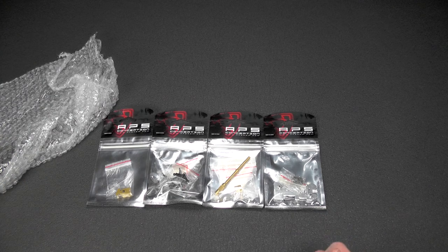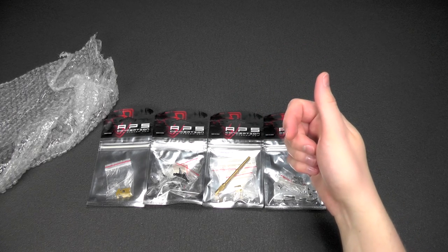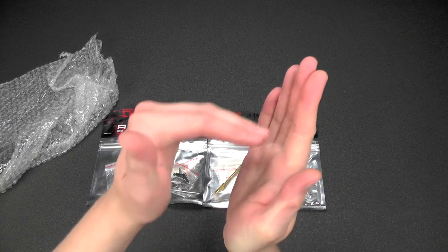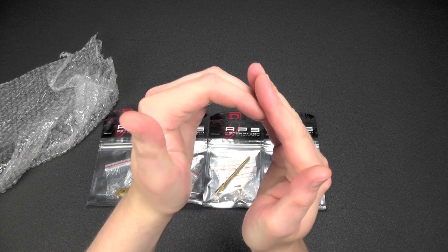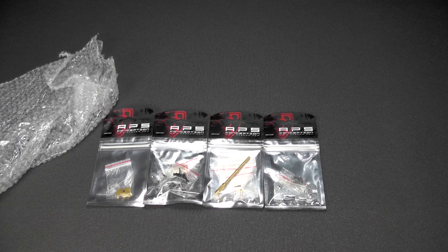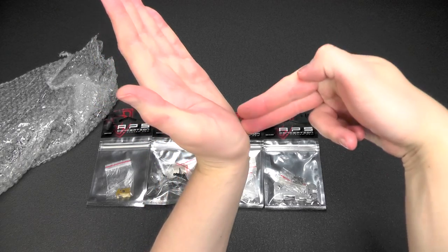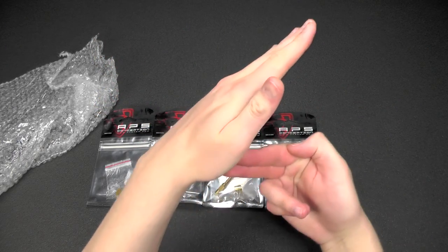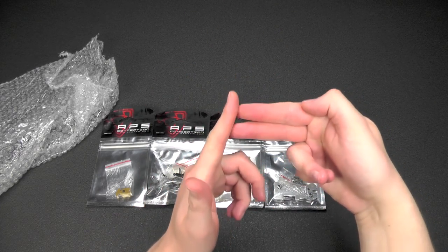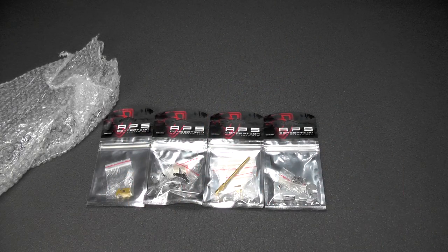The trigger, when I had a look at it, basically, even if I pulled the trigger all the way back, it was not putting enough pivot action on the sear to release the hammer. So it was kind of like sluggishly slipping off the sear. And I found that there was the bar that's pushing on the sear for it to pivot and release the hammer. The front of this bar was just worn down a little bit to where it wasn't having enough length to push the sear.